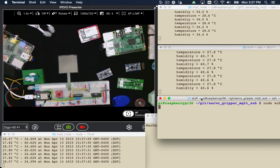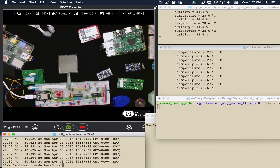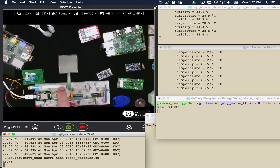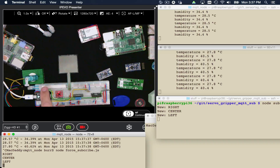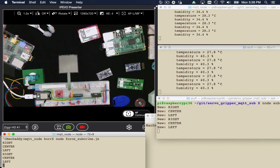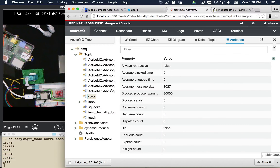Let's run 'node subscribe'. If I did that correctly — I pushed on the right side and it turned that servo. You can see the messages coming in on the bottom there. The microcontroller is reading my interactions with this potentiometer, translating that into MQTT messages, and sending that out to the message broker. Then we see the servo reacting to that. To make that point a little bit better, let's look at our ActiveMQ enqueue — you can see the enqueue rate going up as I interact with the sensor.